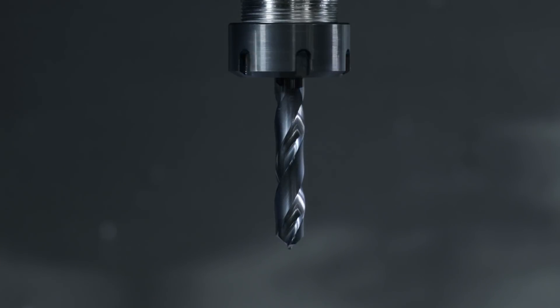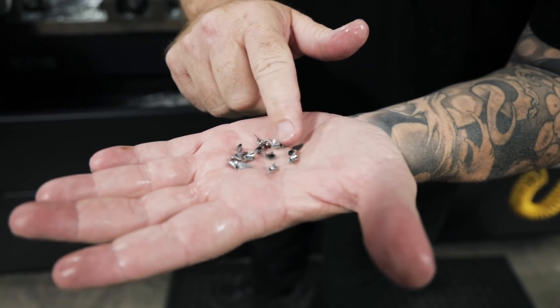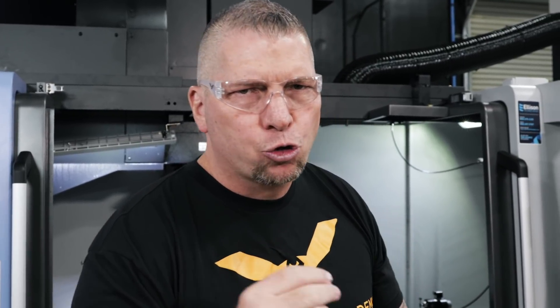A lot of you are going to ask: why do we have to drill that fast? We don't have to — but now you know it's possible. So if you're feeding at 4 thousandths or 6 thousandths per rev, you now know they actually went 18 thousandths, did 200 holes, and the drill looks great. The chips look great. It's like the Matrix — we're freeing your mind so you can look at your application and say: we're drilling thousands of holes. What if we double or triple our cycle time with this extremely free-cutting drill from Kennametal? What would that mean to the bottom line?